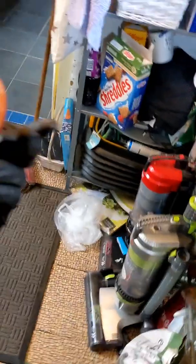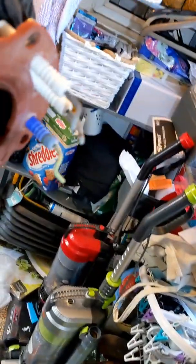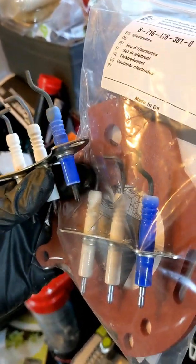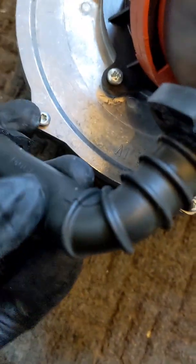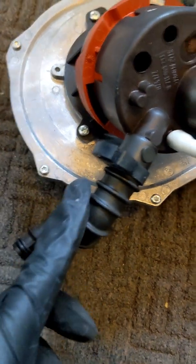The electrodes are actually not in too bad a condition. I've got a new set here — I'll give these a clean up, see how they come up, and compare them to the new set to decide if we need to change them or not. The good news is the electrodes are still in good condition compared to the new ones, so they don't need replacing. I always bring these just as a precaution because you never know until you take them out. The gas pipe tube is also in good condition — doesn't feel brittle, no cracks or splits.